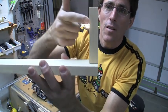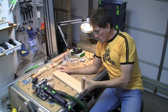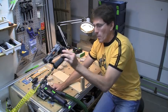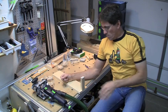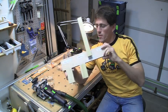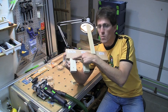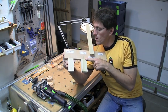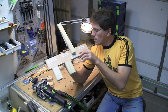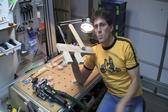Notice that edge — because that was my reference edge I put it down incorrectly, but now it's back flush. For a glue joint like that, you can glue the whole thing but you really want a mechanical fastener. I find the best option is simply putting a small pin through it. On a sample board I made yesterday, one joint was glue-only and one was glued and pinned from behind so the pins don't show. I'll demonstrate the third joint right now — assemble it and then pin it so we can compare breaking strength.